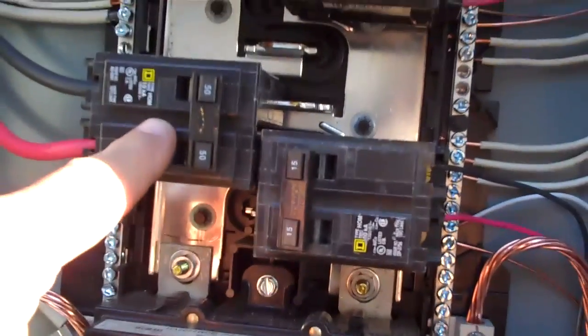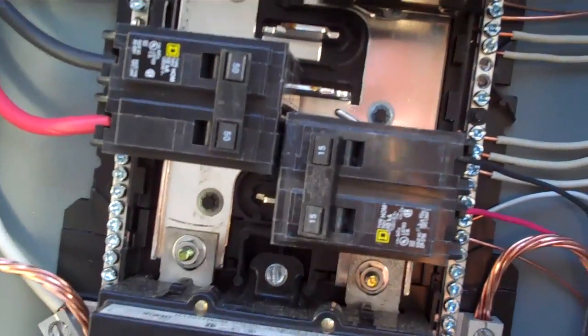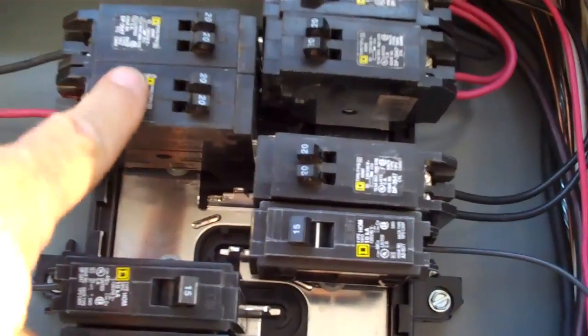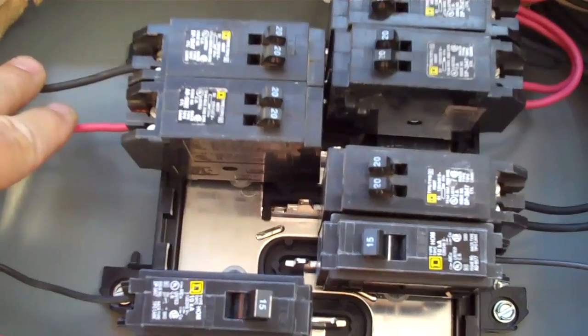Here's a big 50 amp breaker, another 50 amp breaker, and a 40 amp breaker. You can see there's nothing stacked around those to give them plenty of breathing room. Then here are the individual branch circuit breakers — yeah, they're stacked next to each other; we have to do some balancing and we really have no other option than to stack those.